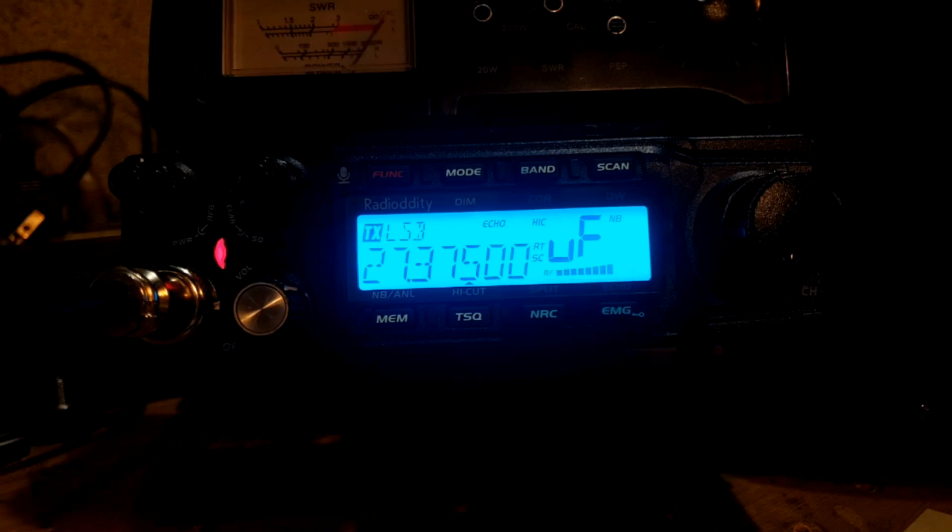Copy that. Yeah, the 2-meter antenna won't affect it at all. You could put it right next to it and not have any problems. It's another antenna that's resonant on the same frequency that will give you an issue if it's too close to that antenna. Below it will work. If you can get it below it, that'll also work. Just not beside it. If it's beside it, you've got to go 50 feet or more. Roger. Yeah, that wire antenna is for totally different frequency areas.